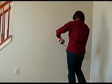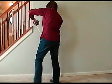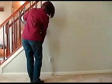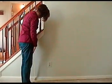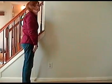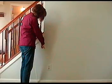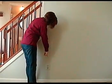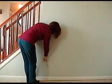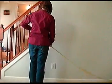So we're going to go ahead and measure from the corner to where the full 8 feet of drywall ends, which is 73 inches. You also see that there's an outlet not too far from this point. I'm going to just leave my tape at the corner and note that the middle of this outlet is at 78 inches from that corner.